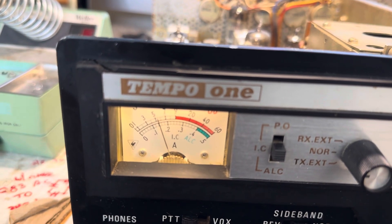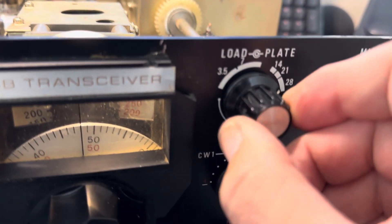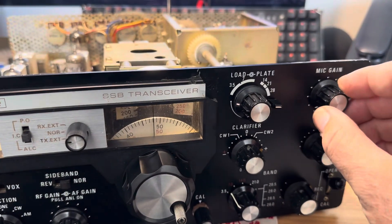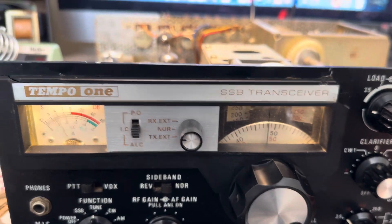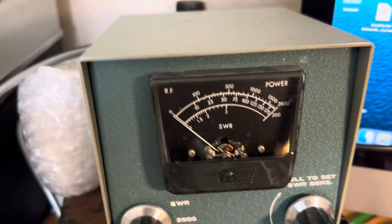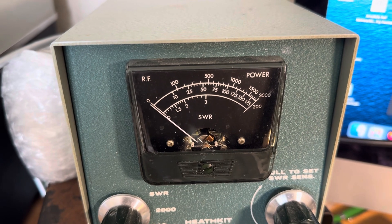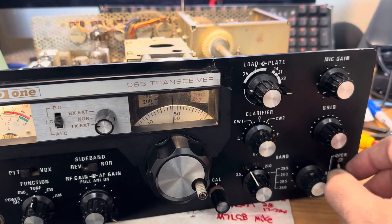There's a peak right there — a little more mic and go for a dip. There's a little bit of a dip there. I tried to get this accurate so it will read 80 meters right there. Yeah, it's pretty accurate. There's some power coming out — you can raise the power here a good bit. Almost 200 watts out on 80 meters, so that's how it goes.